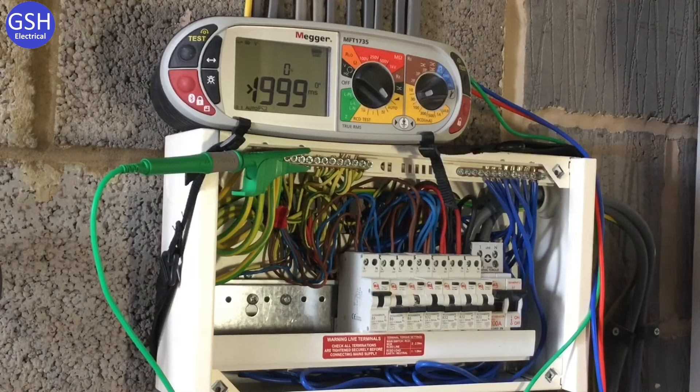After carrying out the measured external fault loop impedance Ze, Graham has a choice: he can add that Ze to his measured R1 plus R2 readings taken dead, to calculate each circuit's total fault loop impedance Zs, or he can choose to go out and measure some of those Zs values directly.